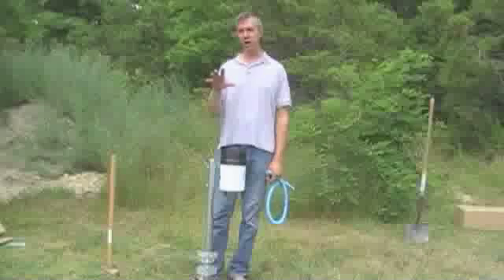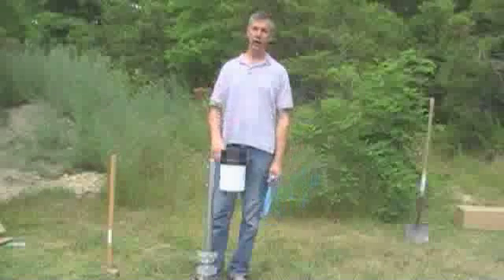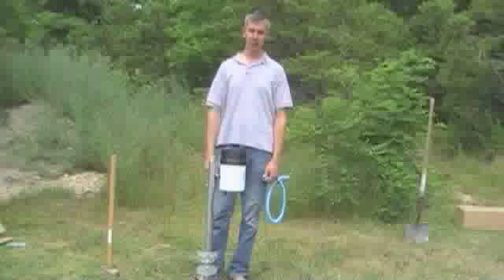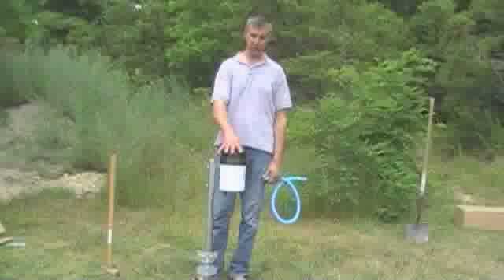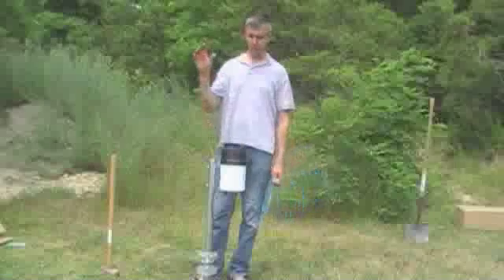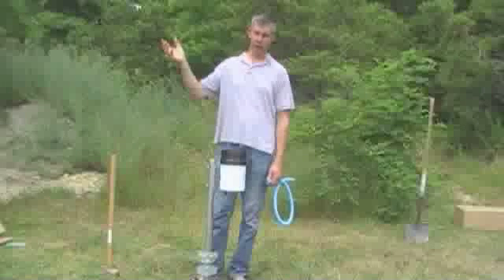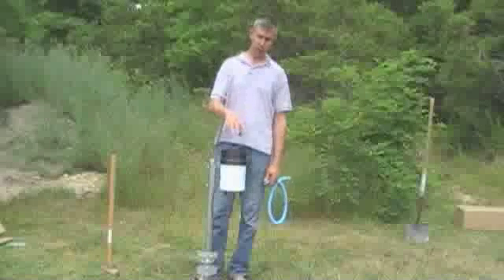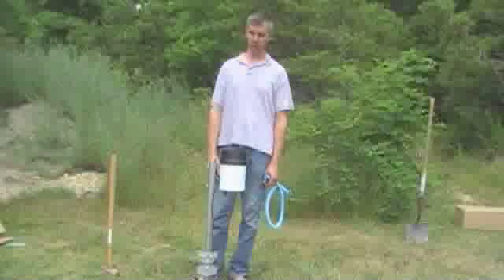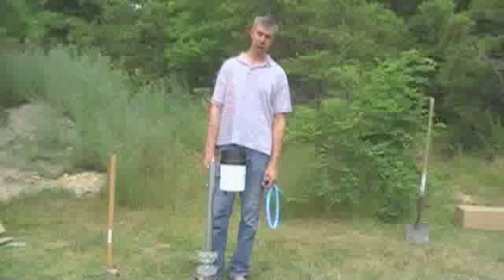This actual site is not the correct way to deploy a rain gauge. I'm way too close to the trees around me as well as the tripod. This needs to be in a location, as we specify in our manual, so that any shedding of water from objects that are higher than it will not come into the collector and give you a false rain measurement. You need to have the thing deployed correctly to get good measurements.